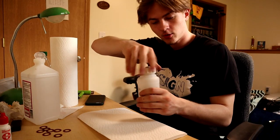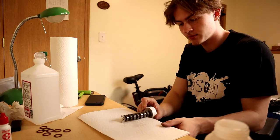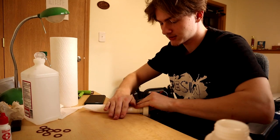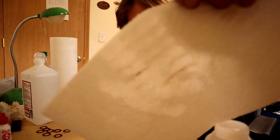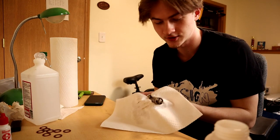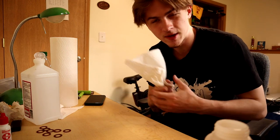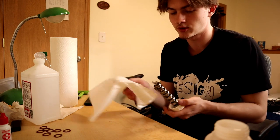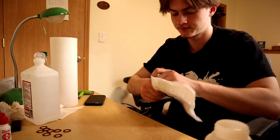Just like that, our minute is up on the second wash. Take them out one more time, set them on a paper towel, roll them out to get all that excess alcohol off. As you can see, there's still a little bit of dirt coming off — rust or whatever is in them. Wipe them and leave them sitting for about a minute to let the isopropyl alcohol evaporate, and then we'll get ready to lubricate them.